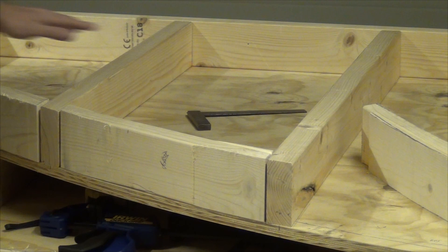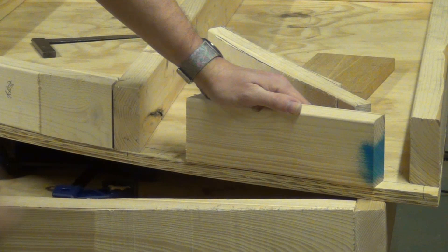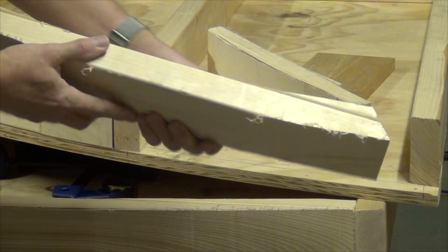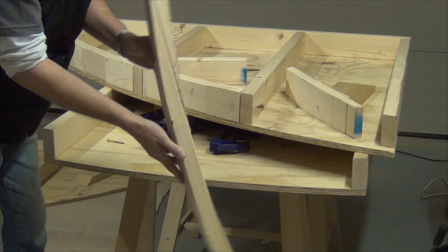I'm just finishing up now by putting the curved section on the front. The way I do that is to take a square piece of timber, place it on the curve so it overlaps, mark the curve onto the underside of the timber, take it to the bandsaw and cut that out. And then what would appear to be waste, I then stick on the back side to thicken up the section. This is the biggest curve I've had to make and that's for the centre section — a straight piece marked, cut off, and some rather large sections glued on the back. And we've got a nice curve.